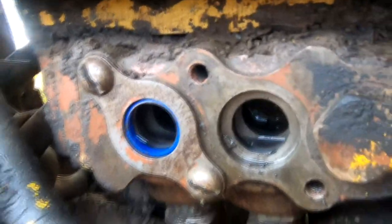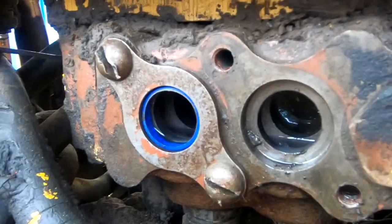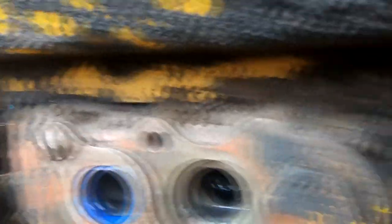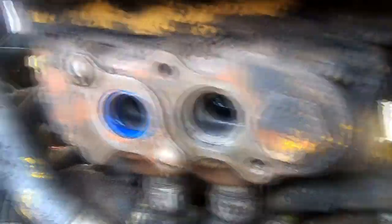This is sort of normal wear and tear. But this valve right here — a little spool valve, hydraulic valve — that operates the loader bucket. There are little seals that go in those holes. That blue one is the incorrect seal for it, but there are seals that go in those holes that keep this thing from leaking. As you can see with all the crud around it, it's been leaking. It took me about a month to locate the proper seals for this thing. But we'll get those installed, get this back together, get the dash plate back on that holds the steering wheel.